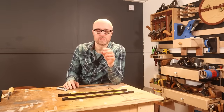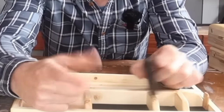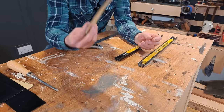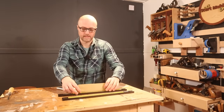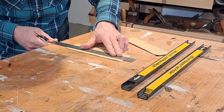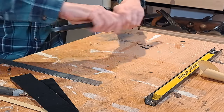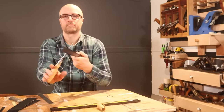As woodworkers, we spend a long time polishing the back of our chisels, making sure they're perfectly flat, and we pride ourselves on that mirror finish. Banging them up against these bars isn't doing anything to help with that. So here's the hack: when I started making jewellery boxes, you could get foam lined with a felt finish on top that was perfect. They stopped making it, so I had to buy foam and cover it with sticky-back velvet strips — they come in an A4 size. These are the perfect way to stop your chisels getting ruined. All you need to do is wrap a piece around the bar and it protects anything you put on it from metal-on-metal contact. You just peel the back off — it's surprisingly sticky — and you don't need to worry about it being so thick that the magnet won't be as effective.